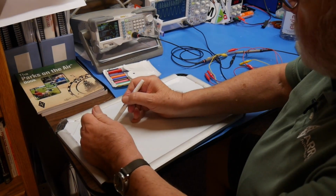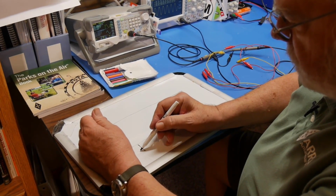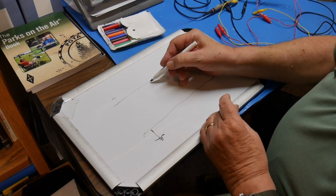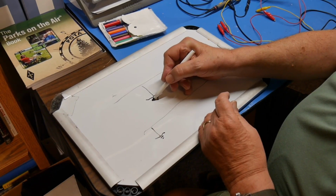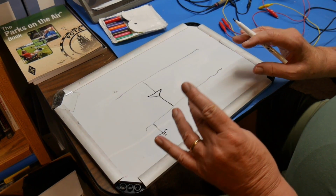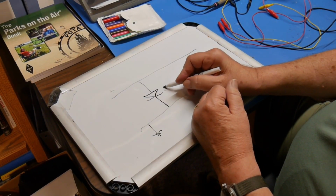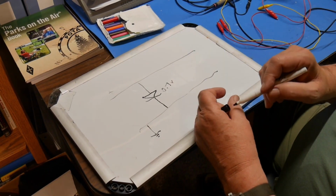So let's suppose you have a line coming in here and a line coming in here, and we'll just assume that this one is grounded, okay? So this one is the hot. What we're going to do is put in a diode going this way. Now you would think that that would short the circuit between the two. Let's get the rest of that diode drawn in. But there's a forward drop of 0.7 volts. Forward is 0.7 volts.